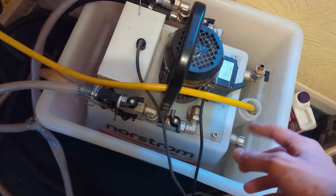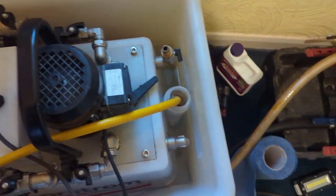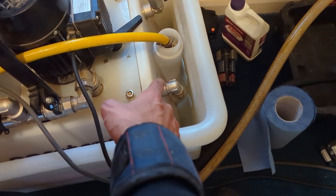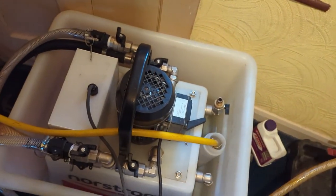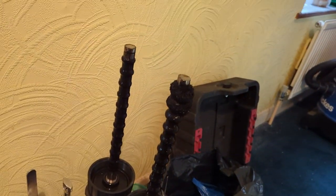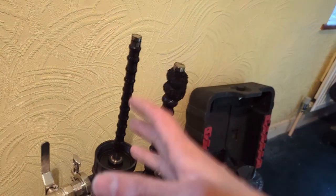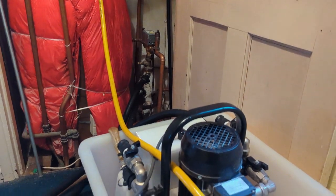That's us doing the last few bits — you can hear it's starting to run dry. All the radiators are done. I killed the power so the three-port moved into hot water position, so we've done the cylinder coil as well. Water pressure in here was so good it was overflowing — luckily I had the bung tab in there. Now I've just got to drain the remaining water. It's picked up a fair bit more on the second pass whilst dumping, which is good — we know we've got as much dirt out of the system as possible.